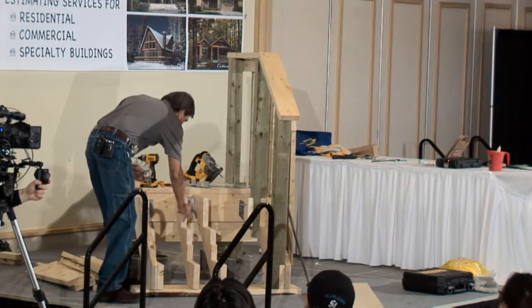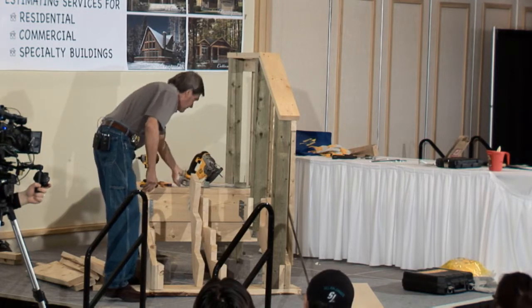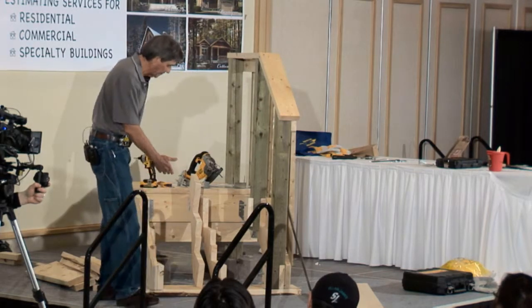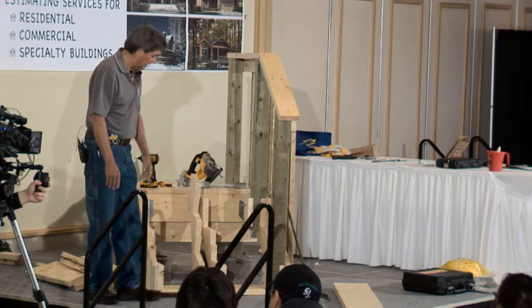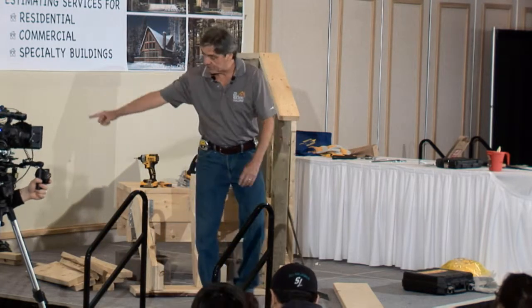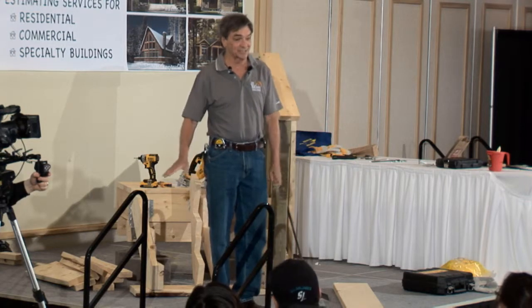On the bottom, you need something that just ties everything together. So a pressure treated piece of wood down there, and it may be sitting on a concrete block if you've got concrete where you live. And then you can just toenail in the bottom. The treads and everything's going to hold that pretty well together. Just toenail into that base piece. So when you're done with your contest, you're going to have one stringer down the middle with that board across the bottom, and everything's attached and cut nice.